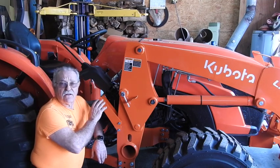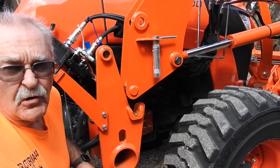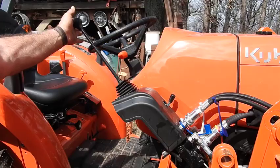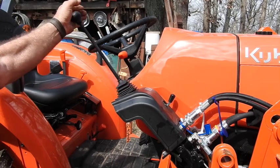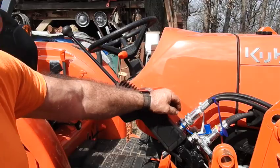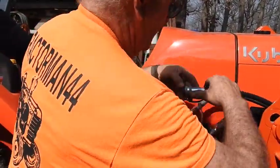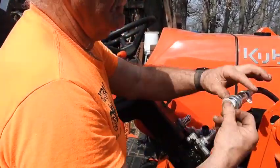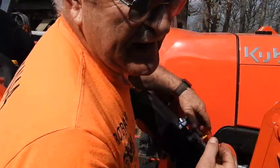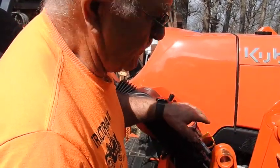So we're going to go ahead and take the loader off. I think that's the first thing the instruction book says. Now, you guys that follow me know I work on mostly old tractors, so this is all new to me — I'm learning as we go along here. To relieve the pressure just move it into every position, and that will relieve all the pressure off your connections right here. Then these should just pop right off. Make sure you have a nice clean rag because you're going to get a little oily. There are three basic styles of couplers: there's a ball, there's a poppet, and there's a flat face. These are poppets on this one here.